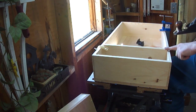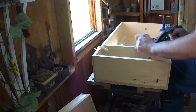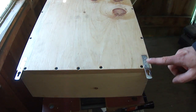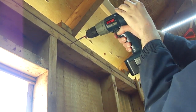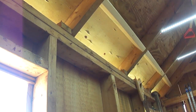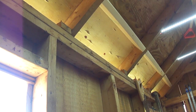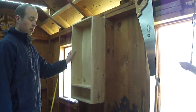Now I can go ahead and plane the little shelf flush with the saw cut. I've attached cabinet hangers to the back of the tool cabinet and I'm going to hang them on two-and-a-half-inch-long deck screws — just like that. It's time to think about the tool holders.